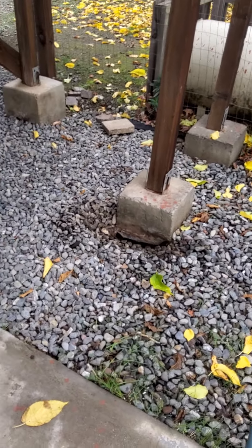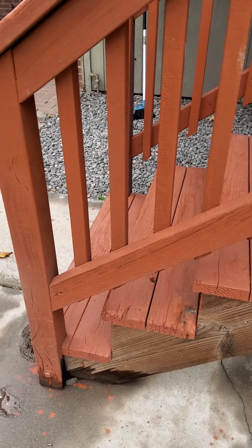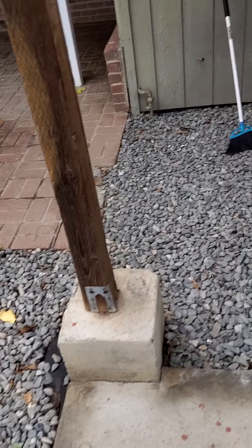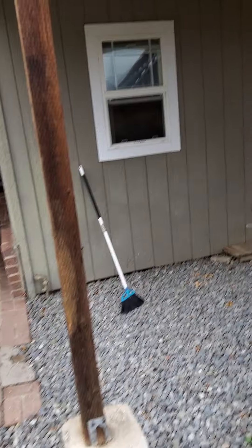That's another reason why I like doing these videos — I like to see on video and try to figure out what's going on. We have moisture damage on the bottom of the stringer right there. This one obviously has to go and get replaced. A lot of these railing members can have all the threads tightened up — you can refasten all of those.